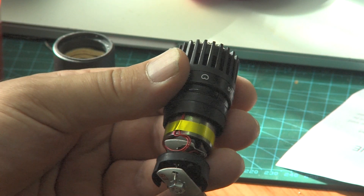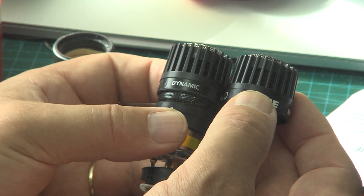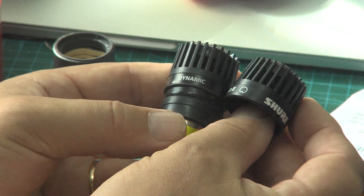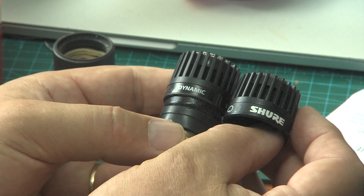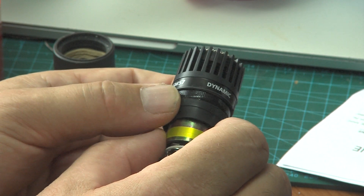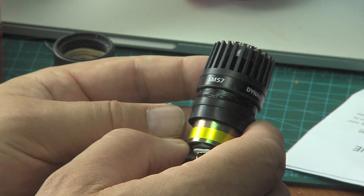Comparing it with the real Shure - in big letters - this one doesn't match exactly. The original Shure cap has slightly thicker fins. The sticker doesn't stick on well, but between the cardioid symbol and the word 'Shure' there's a small dimple - that's the hole where the retaining clip engages on the inside. On this replacement there appears to be a similar mark, but it's unclear whether it's actually a dimple or whether it has the same mounting holes.